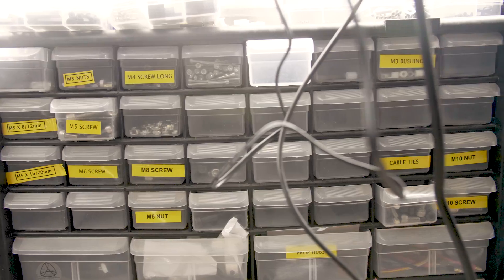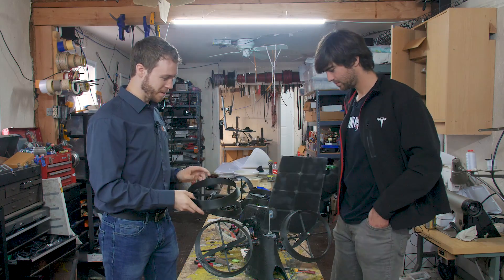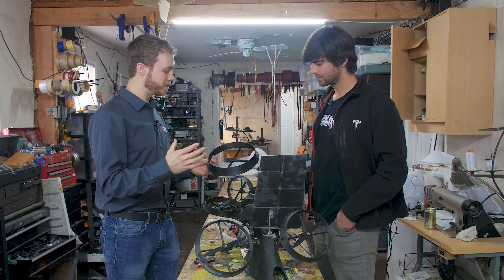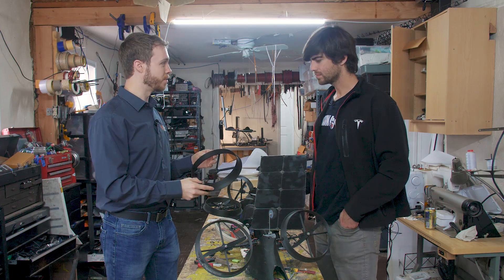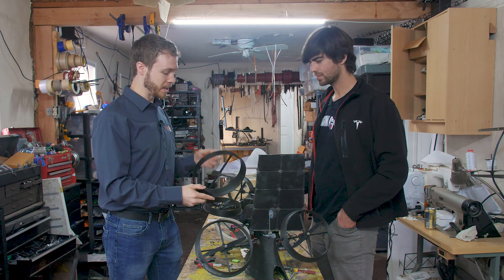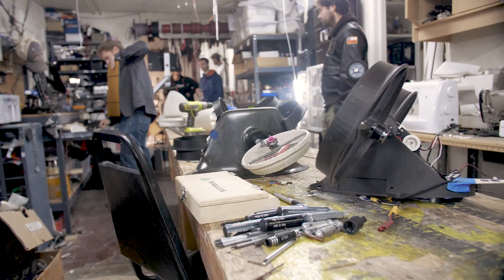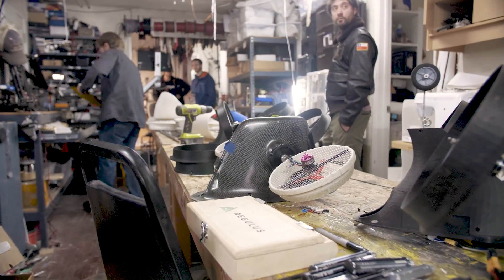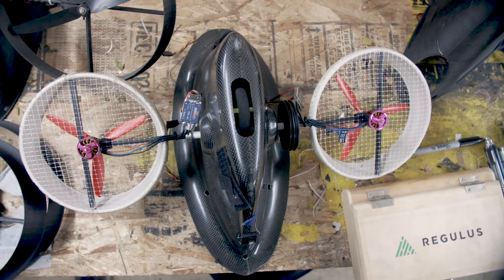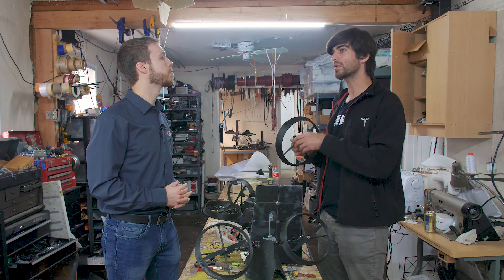You guys use a lot of 3D printing in designing your gondolas. You've shown us some of the parts you make and how 3D printing helps you reduce part count and change the design to reduce weight — even over something made out of carbon fiber — because you've modified the design to be optimized for the 3D printing process. With carbon fiber molded parts you have to have a mold, so there are certain things that when you're molding you are conforming to a surface. Little details like something you're going to put a screw in, something for mounting...